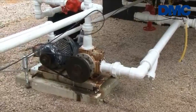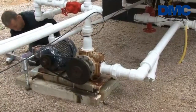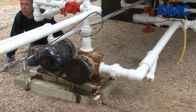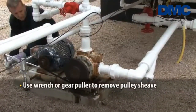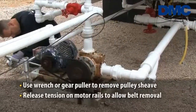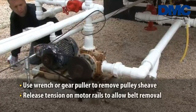There are no changes to the piping that have to be made because of the way the casing of the new Blackmer 3021 series was designed, so no pipe wrenches are required. It's just a matter of using wrenches and maybe a gear puller to pull the pulley and sheave off, which is something that all propane guys have. You can see the tension loosening now because the motor rails adjust the tension of the belts, and once you get that loose the belts will come off.